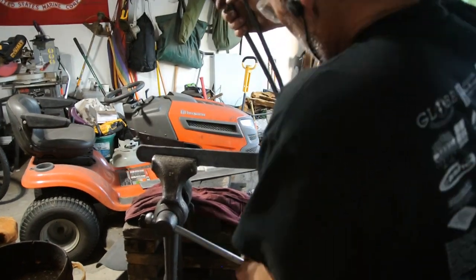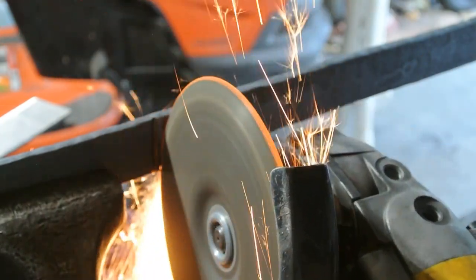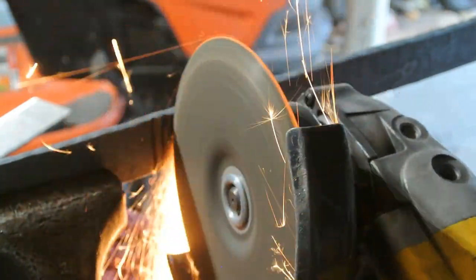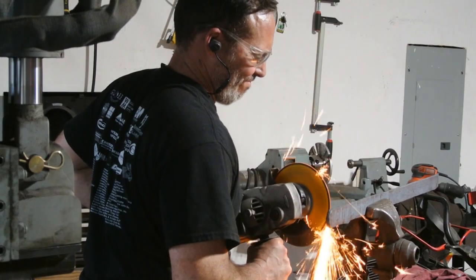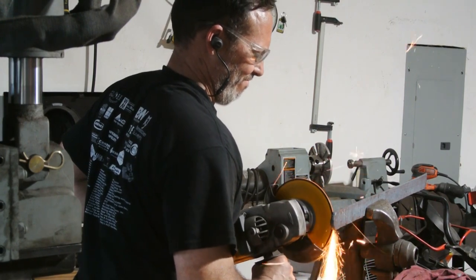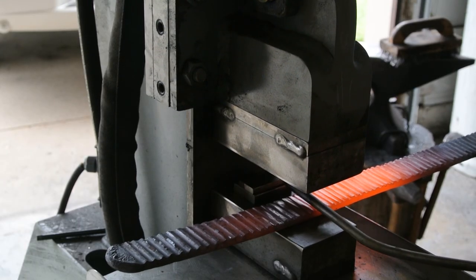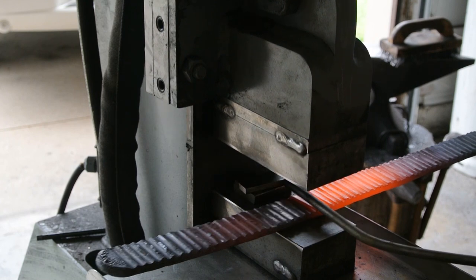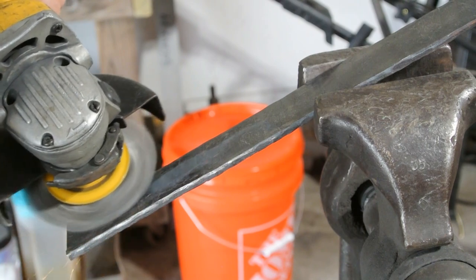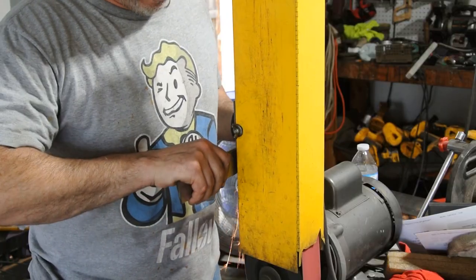Now we're going to let it cool off and do something different — we're going to cut some grooves in it so that it looks like a ladder. This is traditionally known as Ladder Pattern Damascus. It takes a lot of time. We cut these little grooves as close as we can together and it really does make a nice contrast to the overall end piece. Here you can see those cuts we just made, and what I'm doing is trying to get them smashed back out with the press to make them look a little more even. That's the end result where you can't really tell where the grind marks were — we're just cutting that scale off and cleaning the steel up.